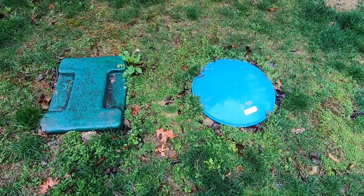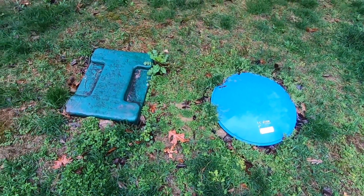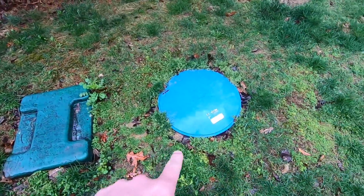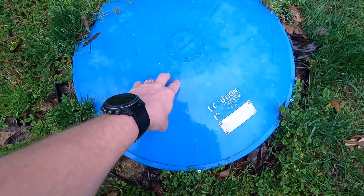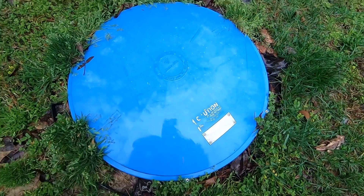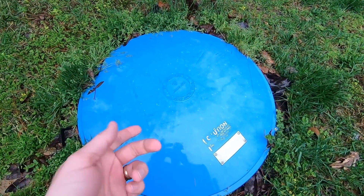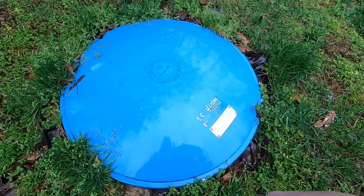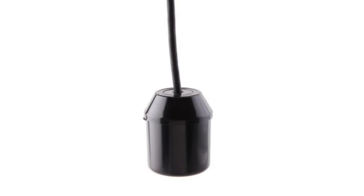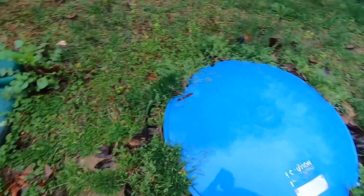If you're used to having this system in your yard, you can pretty much already tell what the problem is. You're used to hearing a humming sound from the ground - that's your pump - and in here you'll hear a churning sound from the water. With the system on, I'm sticking my ear down here and I don't hear that churning sound, so it's a safe bet the air is not getting pumped in. That means it's probably not the water overfill sensor - that works like a sump pump float that lifts up when water gets too high.